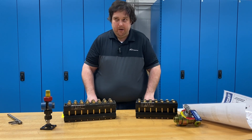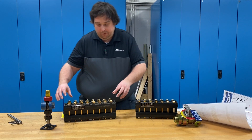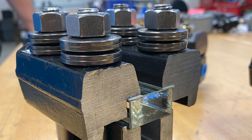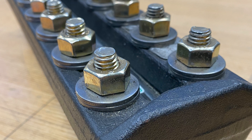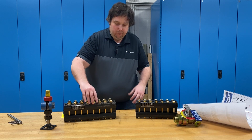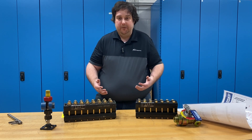Additionally, when we're talking about re-torquing, standard assemblies have your gauge and bolts. We also offer gauges with spring washers, also called Belleville washers. These washers are contoured, and when you tighten them down they put some positive force or strain on the bolting, which can eliminate some of the need for re-torquing. This is always a good accessory to have — a lot of people use these as standard all the time.